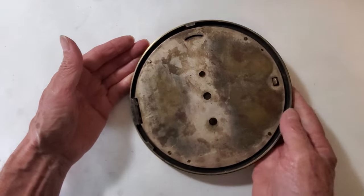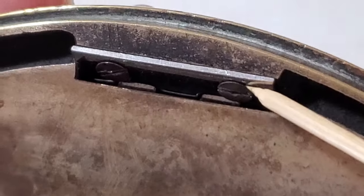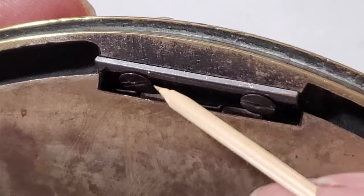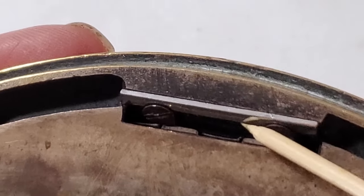The back of the dial looks like it has the original silvering on it. The hinge looks like it's nickel plated, with some steel mounting screws in it — they don't appear to be original, as they don't nest in the countersink fully. Original screws probably would have been nickel plated brass with a better fit-up than these.